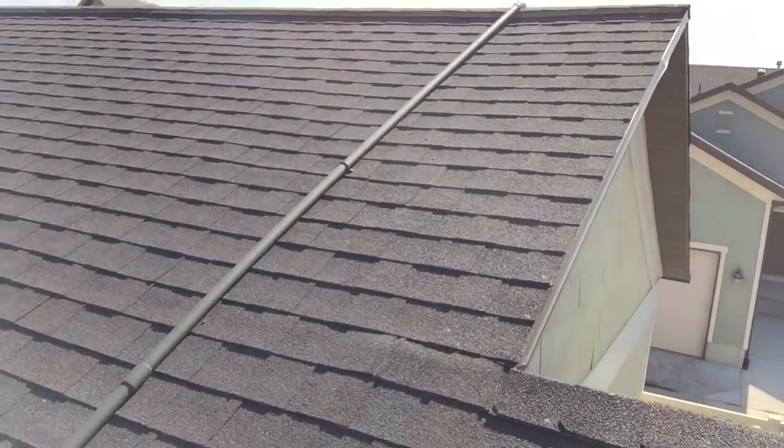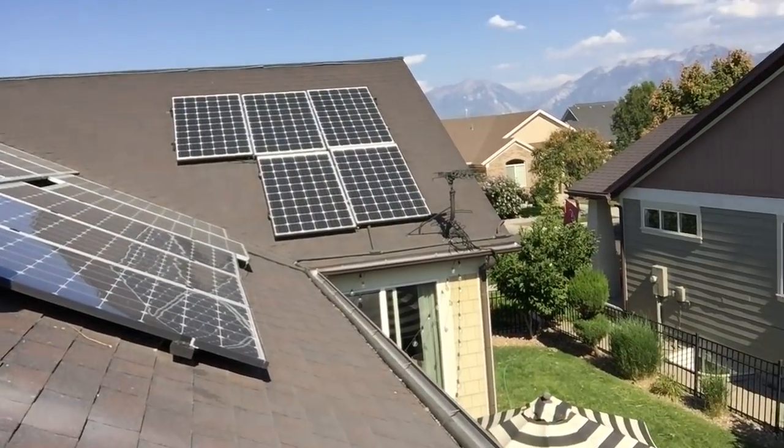I probably would have wired through the attic instead. I used conduit all around and it's worked out well, but I was just kind of afraid of poking holes in my roof. I could have just drilled a hole down and gotten into the house through the attic. One advantage of that would be that it's more protected, and also it would have enabled me to put the inverter inside the house. The inverter gets pretty hot in the middle of the day — the fans come on — and it's just a little less wear and tear on the inverter if you can get it inside.